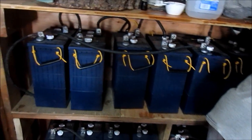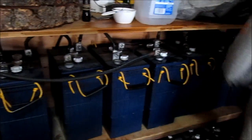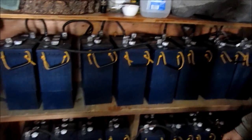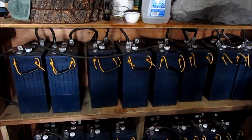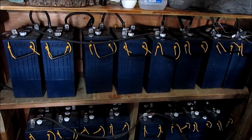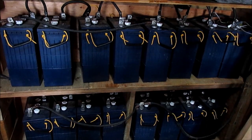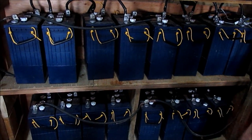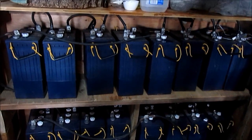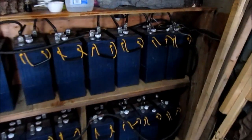They say you should check your battery level every year, but it's also recommended twice a year, like in the fall and the summer. Double check. When you're running the generator, it's a little harder on the batteries. Like you're cooking the liquid inside. Yeah. And so there's more bubbling going on, and you might have more evaporation. And we've been running it a lot. But anyway, that's our setup, and we are living and learning today.